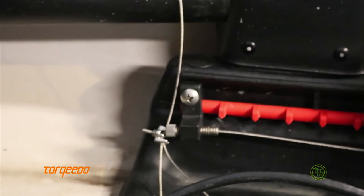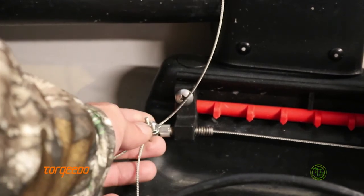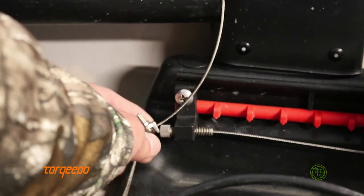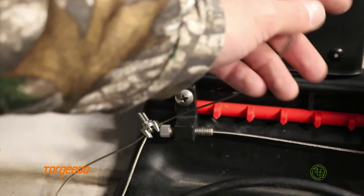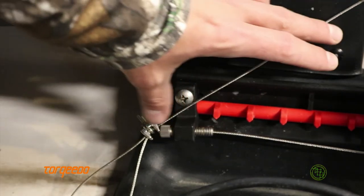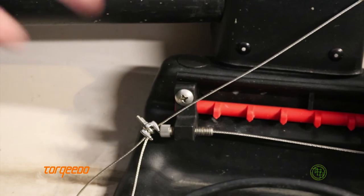Instead of using swages at the termination here, I'm using these cable clamps — it's two nuts on here and a U-bolt in the middle that actually clamps down the cable. That's the way to go to terminate that. Now it's fully adjustable, which is why I left this tag end in, in case I ever needed to clip off a bit at the end or up here. I have about 10 inches of extra cable to work with, and in this loop it's more like a foot — so that's good to have.